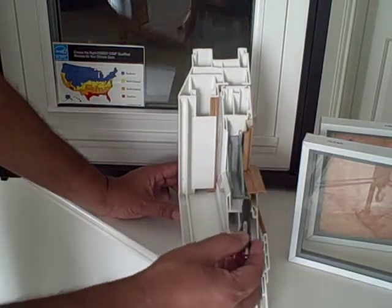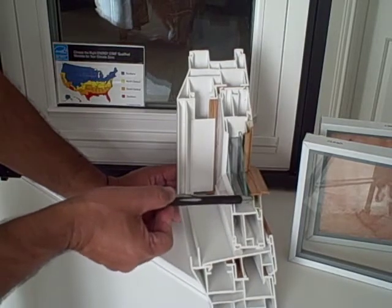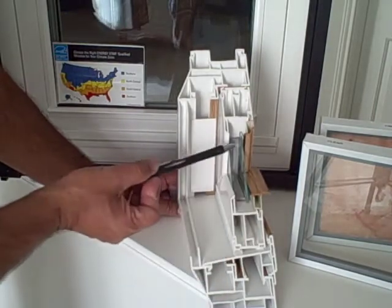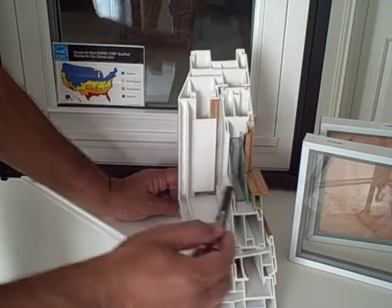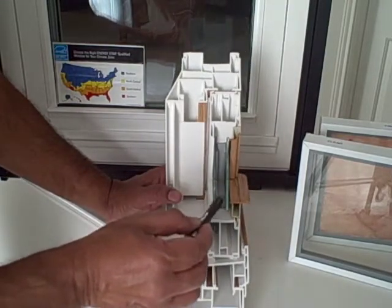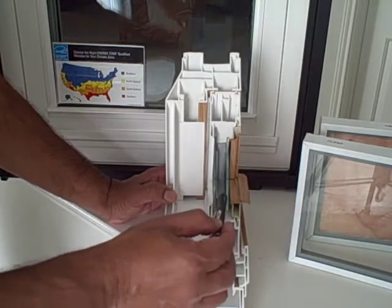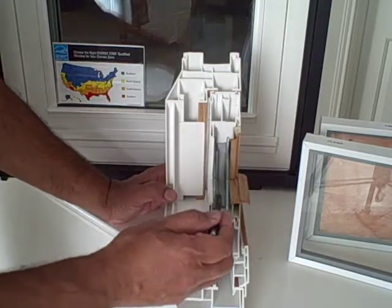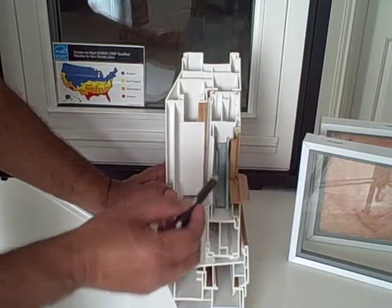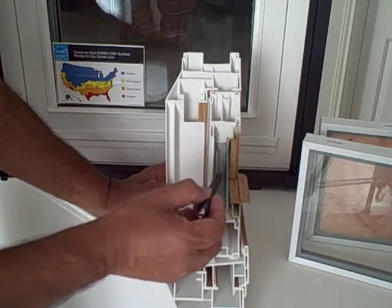We're going to talk a little bit about how we fit this glass in there together. This is totally about one inch wide, a little over one inch wide. These two glass pieces are installed with what we call intercept material, which is a proprietary product called PPG intercept. These intercept spacers keep the windows at a distance apart and also keep the glass from heating up and transferring heat inside. In between these two glass panes, we fill it with argon gas.